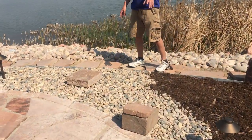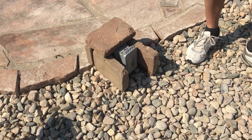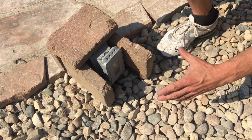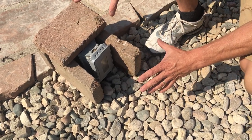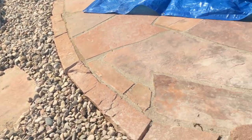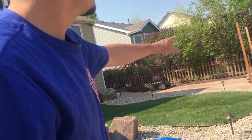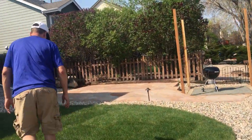We were hoping that this outlet — they told us a wall was going to be here, and they took it out of the plan without telling us. But this outlet right here, they're going to find a cover box for it. What I'd suggest: go to an irrigation place and get a speaker box or some kind of rock box made out of fiberglass or plastic, and just cut it out so you can actually pop your outlet and plug into it. Ideally I would have liked to have it over there in the cove, but they changed that wall on me too, so I didn't know until after the fact.